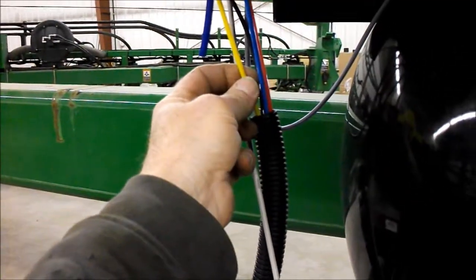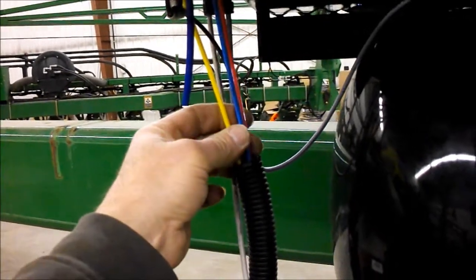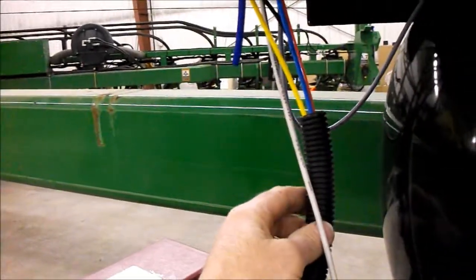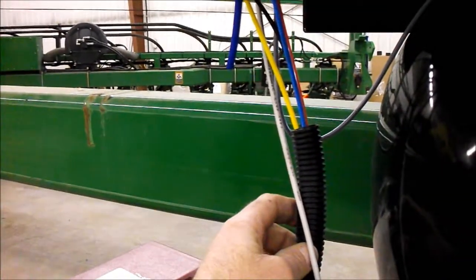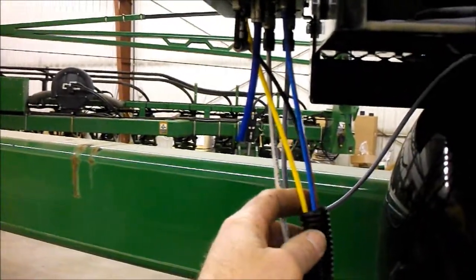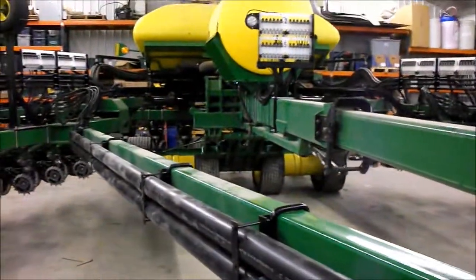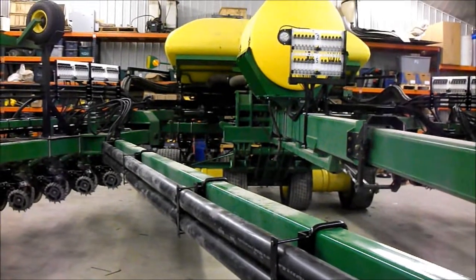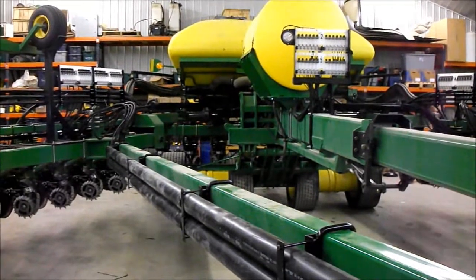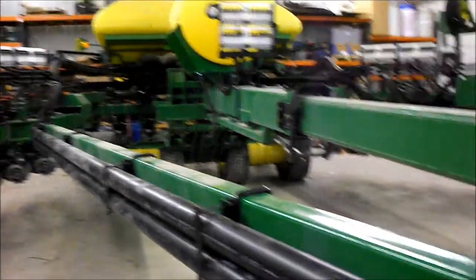You're going to take the small 4mm yellow, blue, red, and black air lines. Use a fish tape to pull these through your plastic conduit laid out on the floor, and you want to leave about 6 inches at the front section. At the back, where it exits up at the other box, you want to leave roughly about 18 inches on each of those colors, with the exception of yellow. You want to leave about 12 foot long. Once that's done, tape all your ends together so they don't slide out.